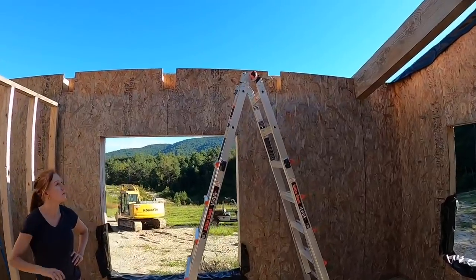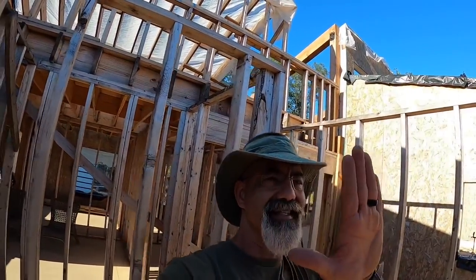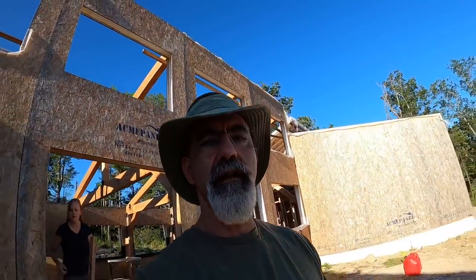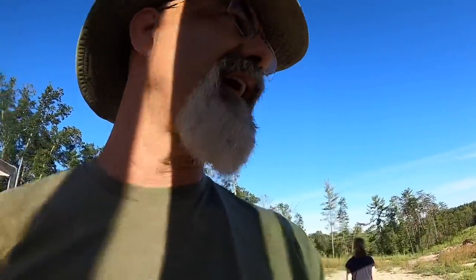We've got a couple of the timbers cut for this room and I've gone ahead and prepped the pocket with SIP seal — quite a bit of it. I've sealed up the seam so that when the timber gets in there it's going to press against it and create a watertight seal between the timber and the SIPs panel, the OSB skin on the outside, and also help seal the seam between the two SIPs panels on the outside. My wife just reminded me to do a dry run first just to make sure I can reach in there — as usual, she's right.